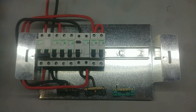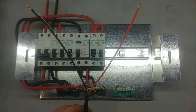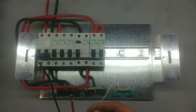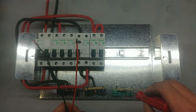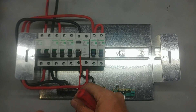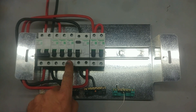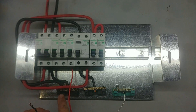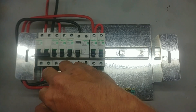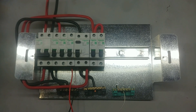Let me show you quickly how I will wire one of these circuits — the light circuit. I've got one of these surface wires which has the red for the live, the black one for the neutral, and then the bare one for the earth wire. I quickly connect the earth wire first to one of these earth bars. Then the red wire goes to the 10-amp lighting circuit breaker. And then the black wire goes on my main neutral bar, because these ones are not on the earth leakage. And that is the lighting circuit connected.